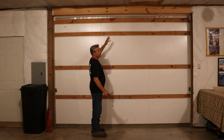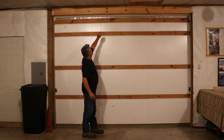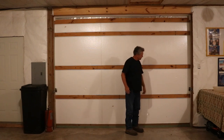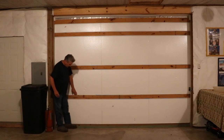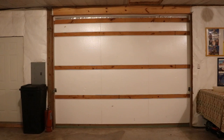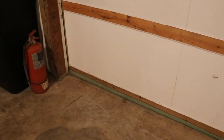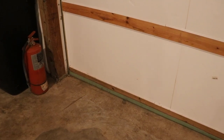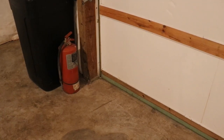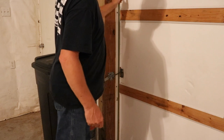However, there is still a little bit of air that gets in from time to time depending on which direction the wind's blowing. On the top part, I used a regular garage door trim that has a rubber seal on it, and that helped me to seal up along that board to keep the air from coming in and around the hinges. Down here on the bottom, that green strip on the exterior is a band board insulation — a quarter inch thick by six inches wide. I simply stapled that along the bottom to trap air from coming in around the two-by-four and the concrete, as well as stapling along this edge to seal this door up.